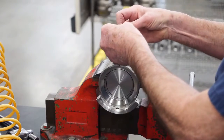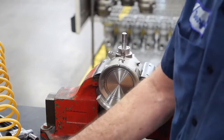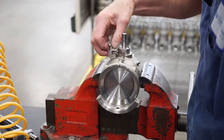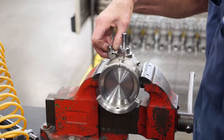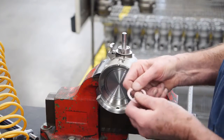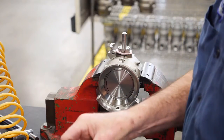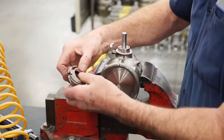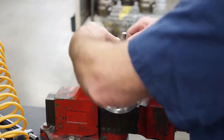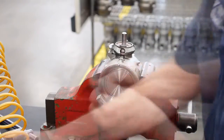The flat end of the shaft should be facing the threaded end of the coupler when reinstalling. With the coupler body securely held, assemble the washer and packing over the top of the shaft. Packing assembly must be installed with the V-notches of the packing pointing upwards, followed by an additional washer. Install the safety release button and the spring. Assemble the big washer and the new Teflon washer over the boss on the body, making sure the safety release button is underneath. Assemble the new bearing into the ramp ID. Then slide the ramp and bearing together onto the boss on the body. The hole in the ramp must be facing the front of the coupler — push the ramp down until it locks together with the latch.